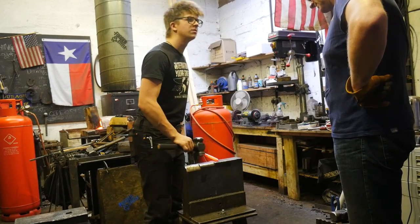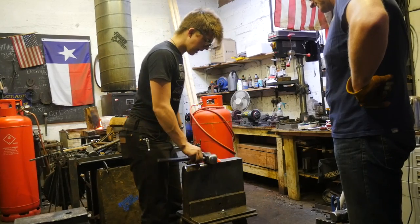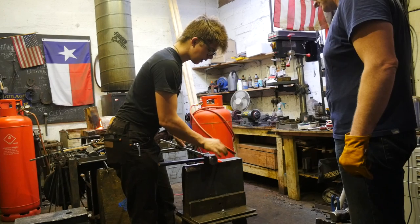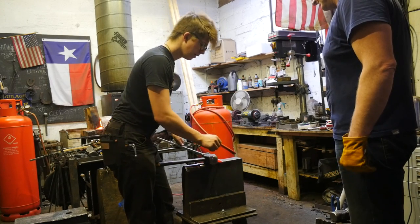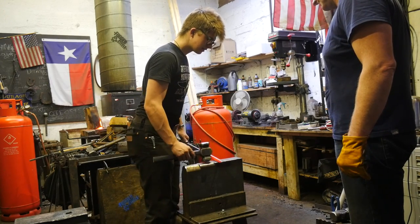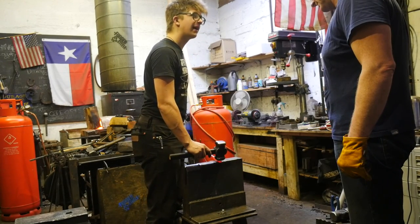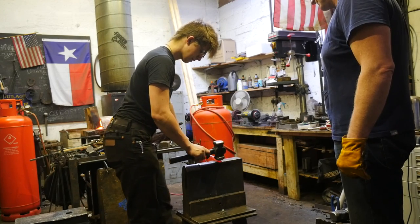Crossbar at a much lower angle, about 5 degrees. Slide it forward so that over the far edge, we have 1 cube of material from where the forging starts and stops. Take the round die, don't strike straight down. Strike at the same angle that the bar is being held.